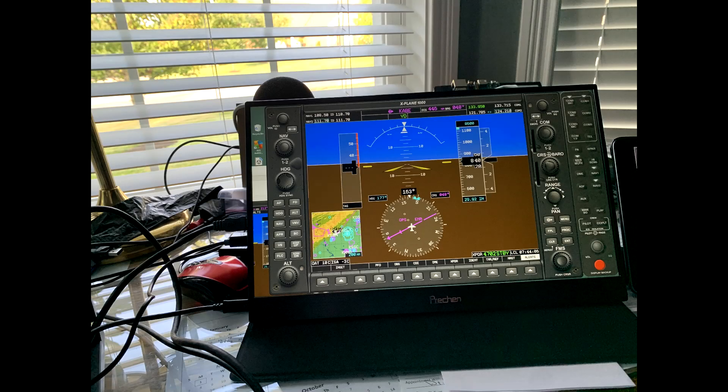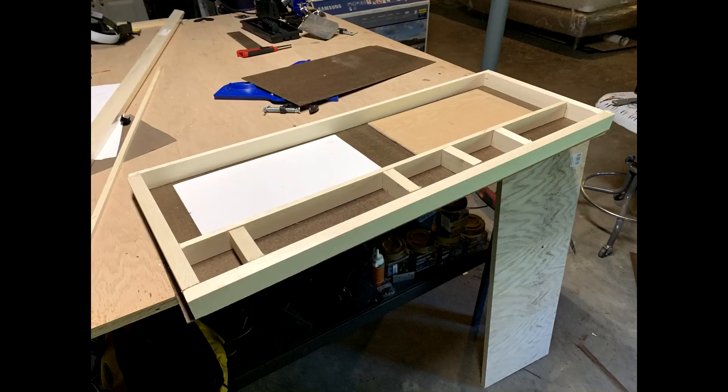In my previous video I explained why I thought these 15.6 inch monitors were just perfect for use in a cockpit — not to mention larger and less expensive than iPads. To guarantee that the monitors would line up with cutouts in the panel, I created a cardboard template by tracing the monitor onto cardboard and cutting it out. Then I measured the inset on the monitor bezel on each side, drew lines, and drilled small holes at each corner, then used that template to drill holes through the masonite for precise corner-to-corner saw cuts.